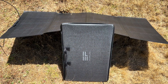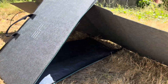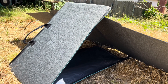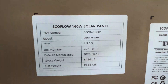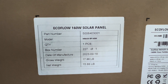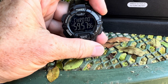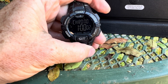This is the solar panel — it's a 160-watt solar panel that comes in a little suitcase and folds out. The suitcase props it up. It's a pretty neat little arrangement from EcoFlow, and there are links in the description to all the things in this video. It's aimed directly at the sun; you really have to aim it properly or you don't get full power. With most of these, 160 watts would be if you were on top of a mountain right below the sun with no clouds, so you never get what you think you're going to get. It says 160, but getting 124 out of it is actually really good. We're now an hour into it.